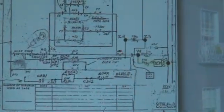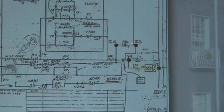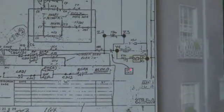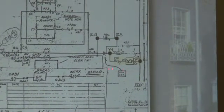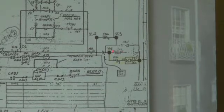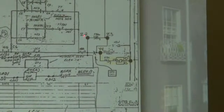When we get to this circuit, we're going to tell you to go to area 2 and make these connections. But we're not going to tell you to open the circuit. OPNCKT means open circuit. So what you're going to do is take all the wires off ASR 10 and put them to Zebra 2.